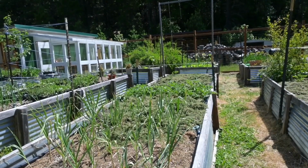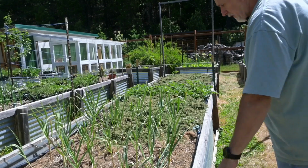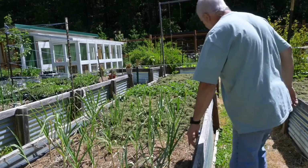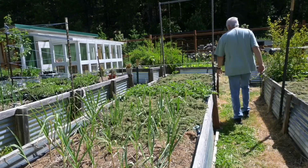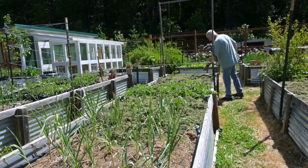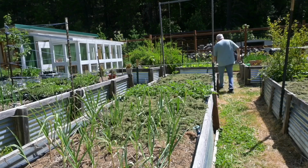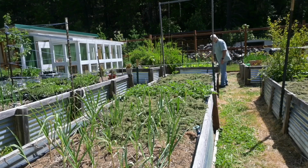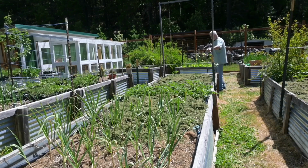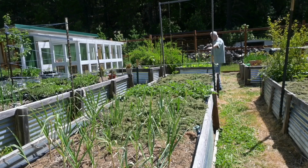if I have another bed that's in line with this one down there, I don't run a separate pipe all the way to that one. What I do is I continue this one on. So I come down here, and on one side, I don't terminate it. I keep it going all the way out the bed, put an elbow in, go down, come over, come up into this bed, and then I start the process again. So this bed is fed off of this one and that valve. When I turn that valve on, it waters both of these beds at one time.